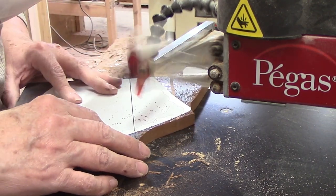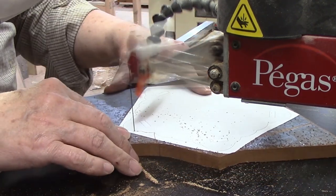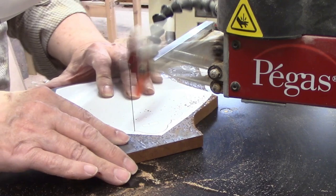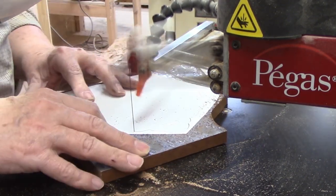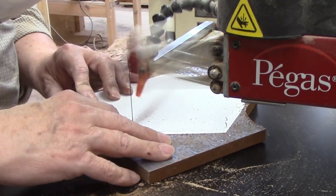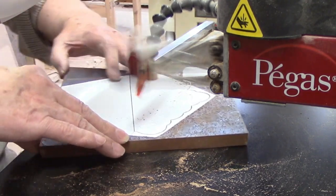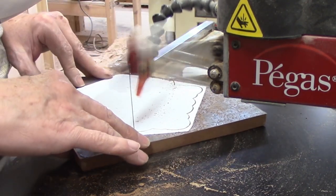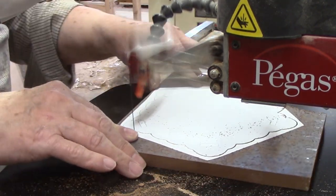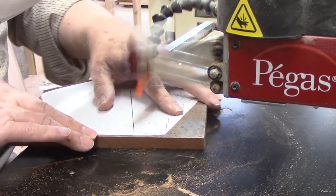I moved on to the backer next. Since I'm not using the slots and tabs for the feet, the backer will be just one long cut. This is half-inch thick material, on the border between choosing a number five or a number seven blade for the cut. I already had a number five Pegas modified geometry blade in the saw for my last project, so I decided to leave it in place to see how it worked for this project. When I choose a blade size, I take into account the thickness of the wood and the complexity of the pattern. For a more in-depth discussion of this subject, I'll leave a link to my video about it on the screen and in the description.